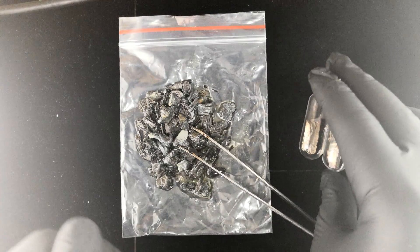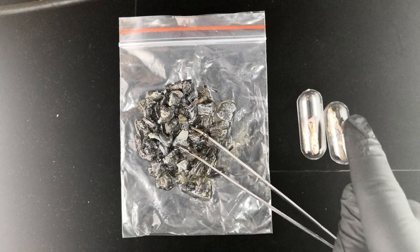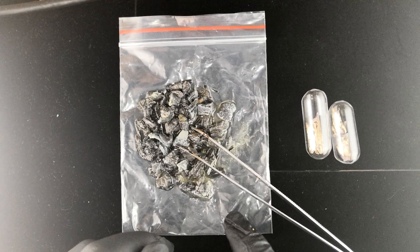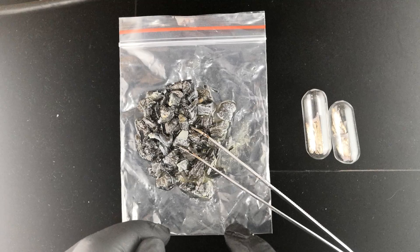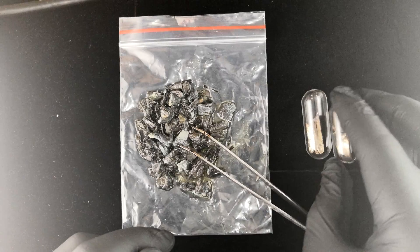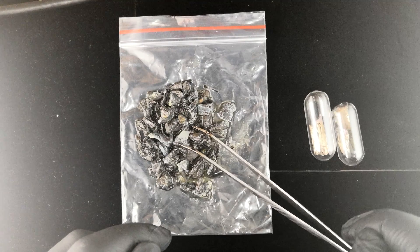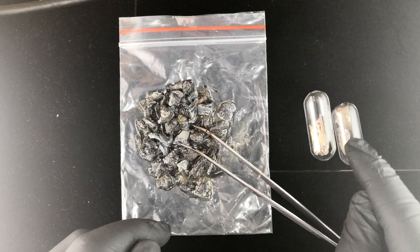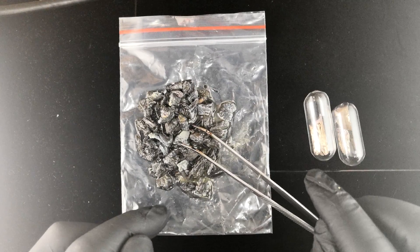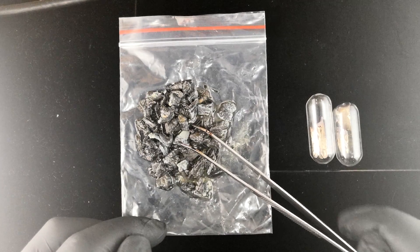It's about $500 a kilogram if you buy it in kilo quantities in big drums. The lab-grade stuff, of course, gets a whole different treatment. I think it starts out in drums, but then they melt it in a vacuum furnace — nothing in the vacuum chamber — which keeps it oxygen-free and nice and shiny. Then they slice off little pieces of it while it transfers from the vacuum furnace into a glove box that is bathed in argon constantly. And that's how you get that.